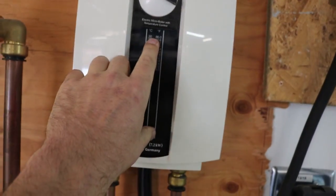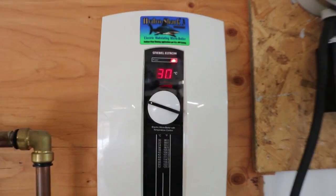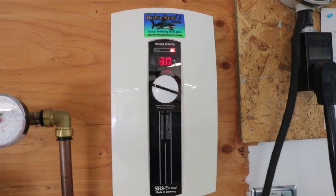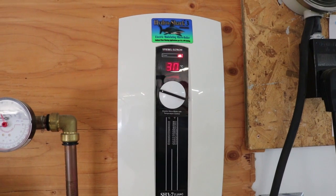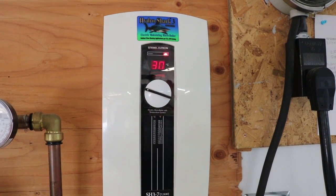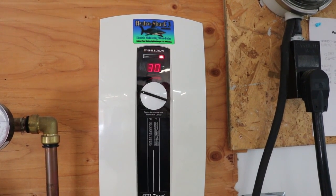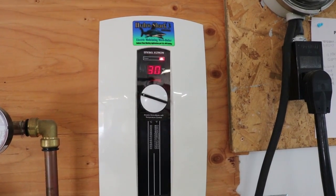Fortunately, it also lists Celsius and Fahrenheit right down here. One thing that's pretty neat about this is it's a relatively low temperature system. Essentially, I'm running hot tub temperatures. Running warm water through a very large area is a good way to heat something. A smaller heat source like cast iron radiators requires much hotter water to output the same amount of heat.